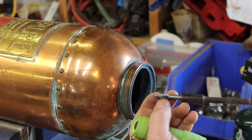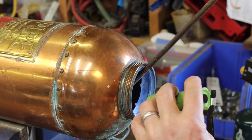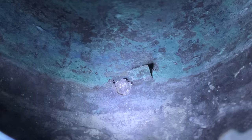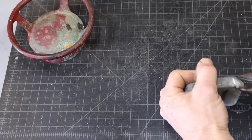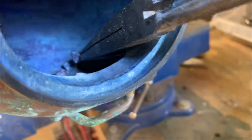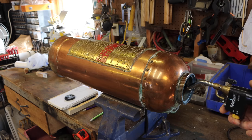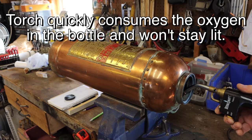What I'm using is a carbide burr, just scraping that area to get it down to fresh lead. Yeah, that metal is definitely lead — very soft. So that's what it looks like after scraping it with the carbide burr. This is an old diving weight and I'm just going to cut a piece of lead off of this. That's plenty of lead to make up that hole, but I'm just going to take a torch and heat up that area and see if it will melt the lead.